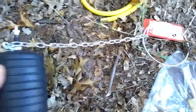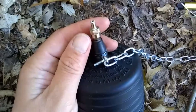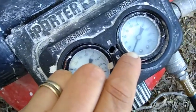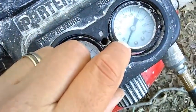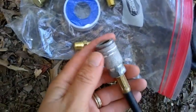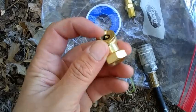This is a pneumatic plug — it means an air plug that you fill with air. It's also called a test ball or plumber's test ball. To fill it you can use a basic bike pump, but I have a compressor so I'll use that instead. I have a couple of adapters and fittings to secure on the end of my quick connect so I end up with something that looks like what you'd see at a gas station to fill your tire pressure.